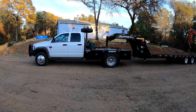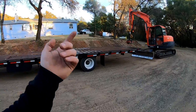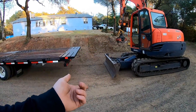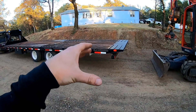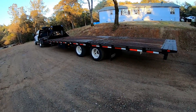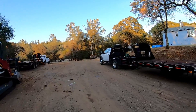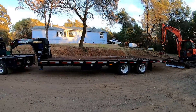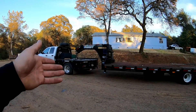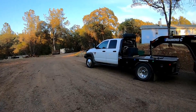I did scotch the truck — not sure if I showed that on the clip — but she was scotched. This one is in a completely level spot, and the hydraulic tail acts as a scotch block because it's a drag. Just like putting a bucket or blade down on a piece of machinery, this thing pushes into the ground, holds it locked right there. It also applies pressure to the ground so the tongue of the trailer will not lift. Back in the day my dad had a little 10k-rated tandem single-wheel rig on a slope, and it picked the tongue of his trailer up and lifted the rear axle on his truck.